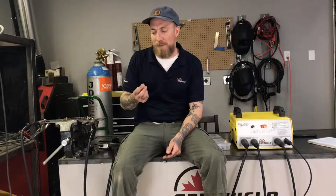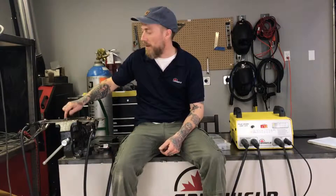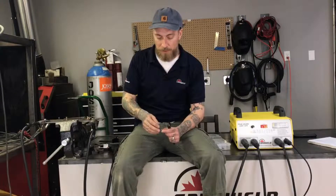This is pretty cool stuff. I'm not very familiar with stud welders being a welder myself, but the part I really like is that it takes a millisecond with the capacitor discharge to fasten one of these to the plate. When you flip it over and look, even though this is pretty thick stuff, there's no discoloration or marring on the back, which is really nice if underneath is going to be the finished side of a project. Or maybe you're working on something huge and you can't get to the back of it to weld it — now you don't have to drill holes and tap them and put bolts through. You can just use something like this, blast yourself a stud on there, and hang whatever you need to.